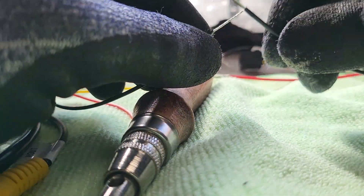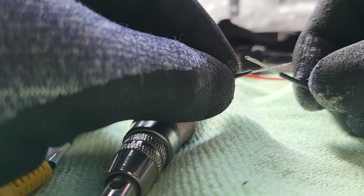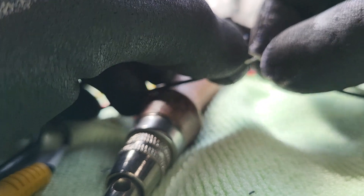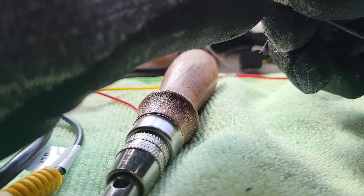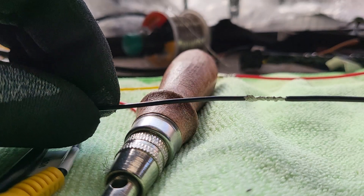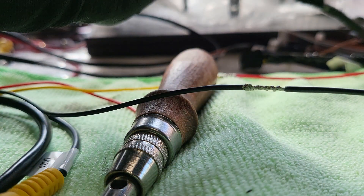What we do and recommend for a very clean and nice installation is: you twist the wires together at the length you prefer, then do a two-handed twist — give it about three twists. You can see that at this point it is almost straight by itself, very straight. And now that is ready to be soldered — that is clean.